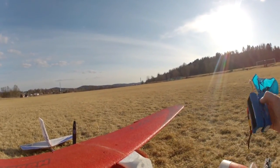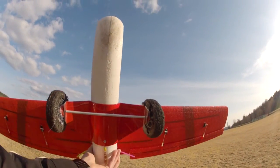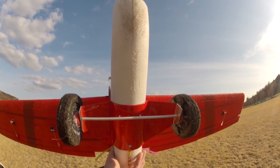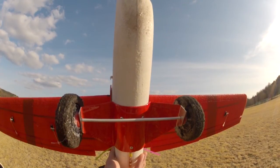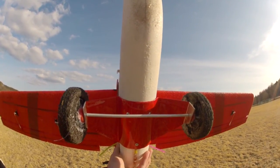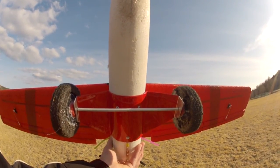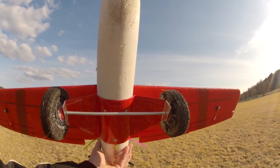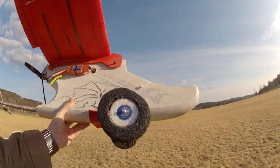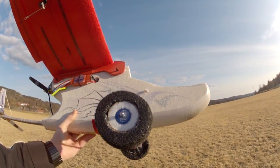Another major thing I've done to this airplane is the landing gear. I think there will be a few questions about this. I just opened up three holes in the fuselage with a soldering iron and epoxied in three of those plastic wall anchors you use to screw stuff into concrete and plaster walls — I use those as mounting points. The landing gear itself is just folded 0.8 mm aluminum. The wheels are ugly but they work — those are soda can caps, some foam and some packing material. I start and land in about two or three meters, so I don't need much rolling distance.